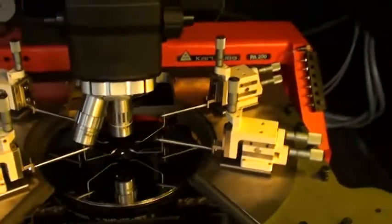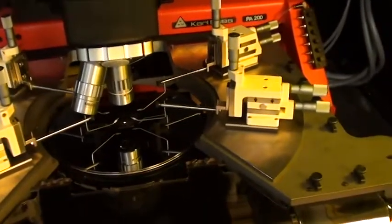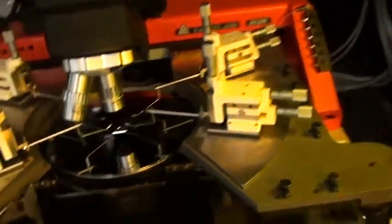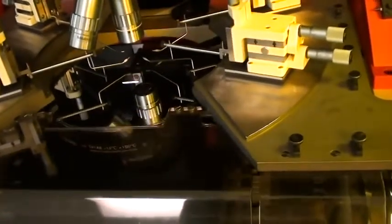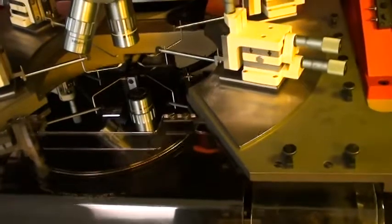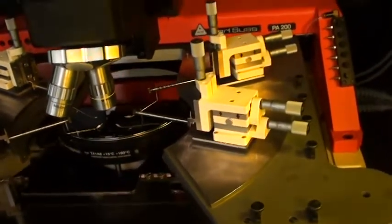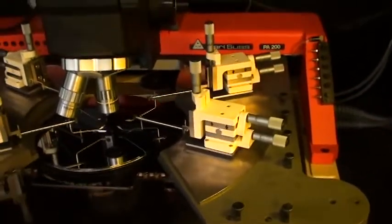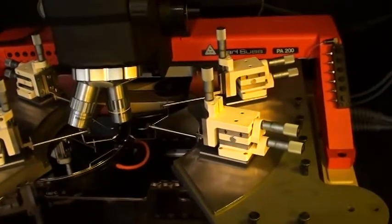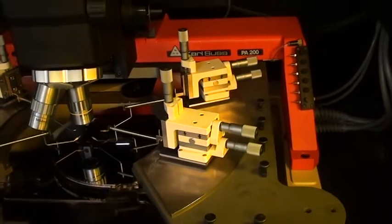We went through all the lead screws, assemblies, recirculating ball assemblies for like the Y-axis, X-axis. I'll change over to the chuck here so you can see it move. It moves smoothly. As I said, the bearing slides and the lead screw have all been lubed, and you can see it moves through the full 8 inches of travel for an 8-inch chuck.